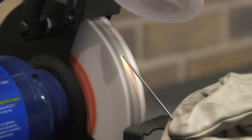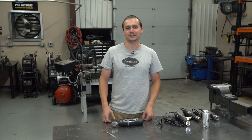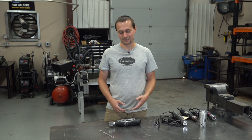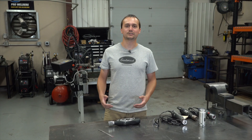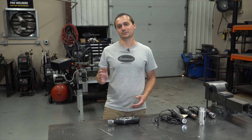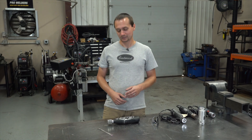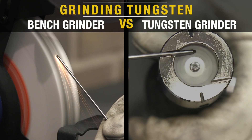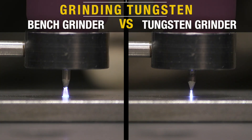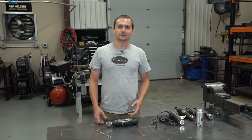So why can't you just sharpen your tungsten with a bench grinder? Technically, you can — you'll get okay results, it'll work — but it's attached to the side of your wall, it's not easy to use like one of these cordless units, and your welds aren't going to be quite as great. Here's why: we did a little side-by-side test out of curiosity to really understand what these things are doing. We ran a bench grinder with a dedicated wheel against one of our tungsten grinders. These tungsten grinders have a diamond wheel, and with the angled guides, you can get a really precise grind. With the bench grinder, the arc wanders — it's not consistent, not as straight. With the tungsten grinder, the arc is much more stable, smooth, and more consistent. Ultimately, that translates to a better weld.